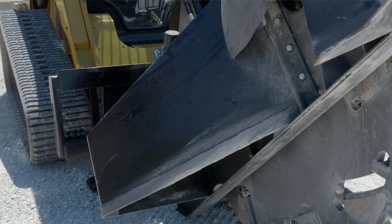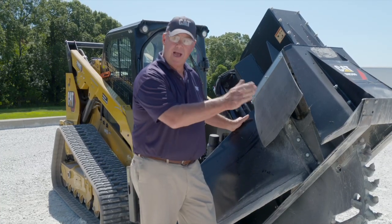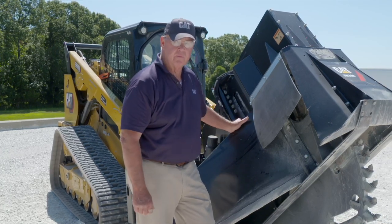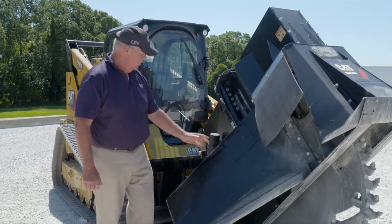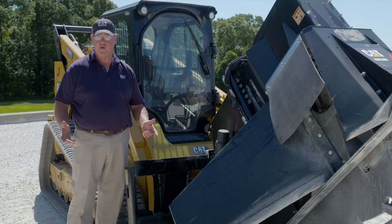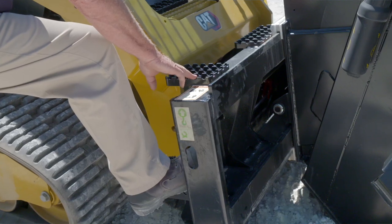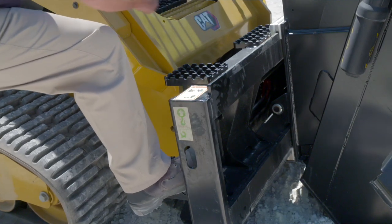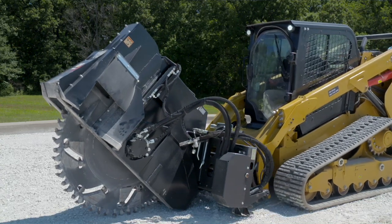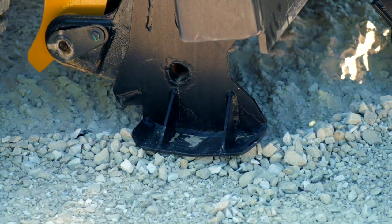This is our right side deflector to move the spoil away from the tool. Another option with the SW360 is an optional guide bar that will allow the operator to follow a line up ahead of him. Moving back here, we have a waterproof OMM container that stays mounted to the tool. Another feature with the SW360 is serrated weld-on steps that allow the operator to comfortably and safely enter and leave the cab. One other feature is an integrated self-standing frame design that allows an operator to easily detach and store the work tool attachment.